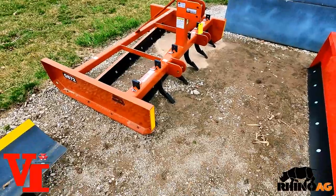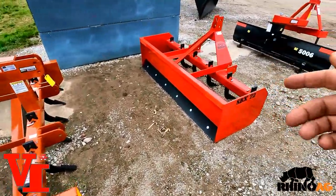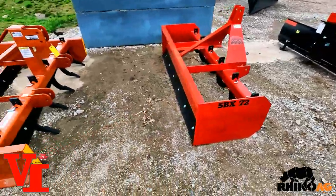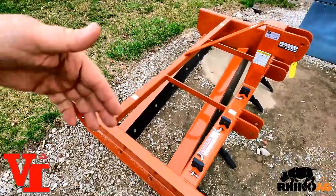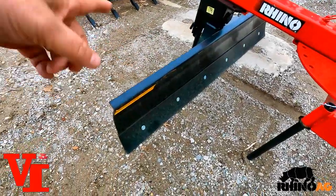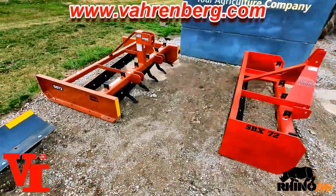The biggest disadvantage of the grading scraper is that it's a one-directional tool — you pull it forward; it's not designed to work in reverse. The box blade, on the other hand, has a double grader blade so you can swing it around and push backwards. Also, the grading scraper doesn't move large volumes of material from one area to another — where the box blade's open design and even the grader blade's moldboard can carry or push significant material forward or backward.